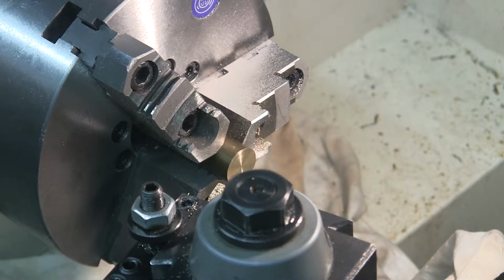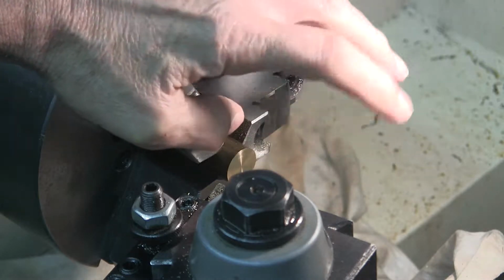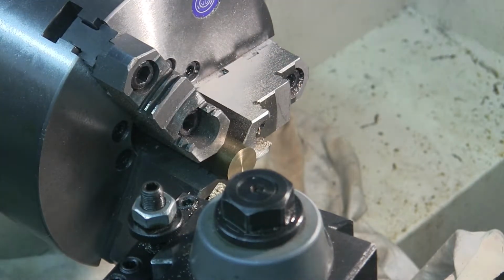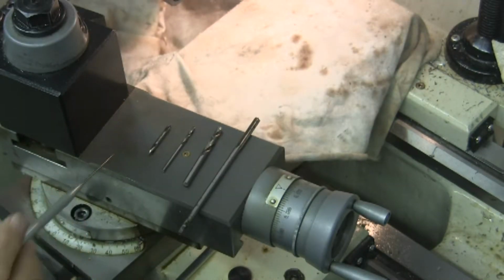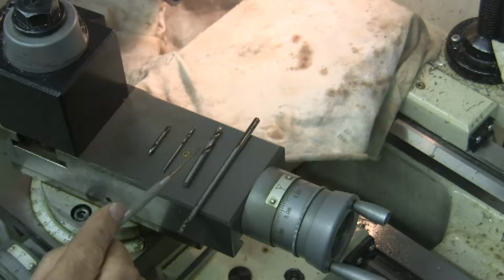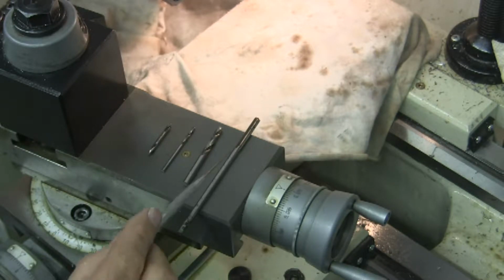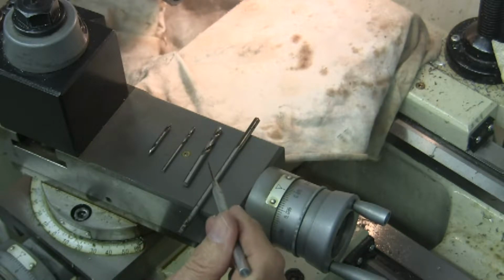That looks good. Now I'll set up to drill this one size under 3/16 and then ream it 3/16. I'm going to center drill it, step drill it 3/32, then drill it with a number 14, which is 0.182. That'll get me closer to the 0.1875 final dimension of the reamer than an 11/64, which is 0.172. So this will get me quite a bit closer.